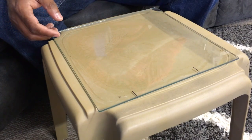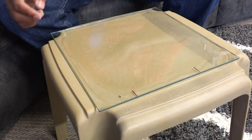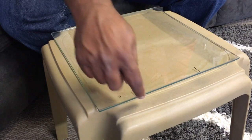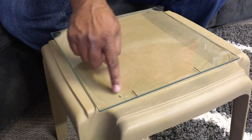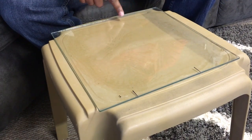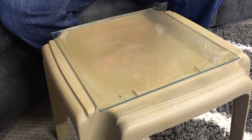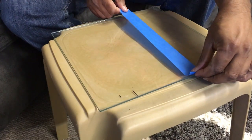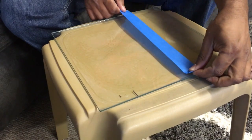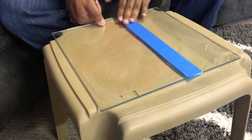The glass is dirty but I'm not going to be using it for printing — this is just for demonstration purposes. The lines at the bottom are where I marked when I leveled it up. This is where the paper grabbed, here it didn't grab, and here it grabbed. Same thing: grabbed here, didn't grab here, grabbed here. The easy way to fix that is to lay the tape right inside that line.